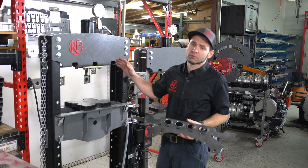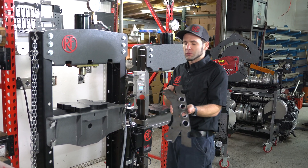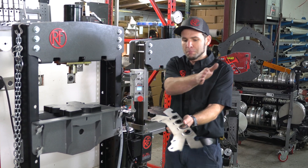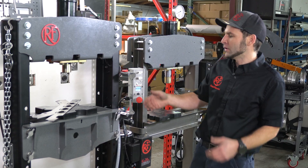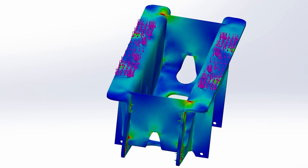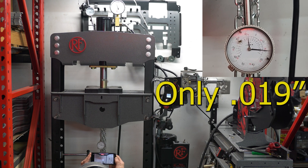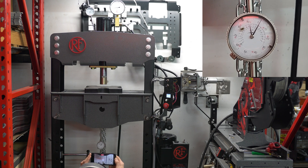The VersaPress is really great for precision pressing and will be great for press brake operations once released. This part is going to be formed right down these ovaloid cutouts. If you have a really flexible table — like the one in the Harbor Freight 20-ton press — and you put a press brake in there, that table is going to bow near capacity. That bow makes your bend form a smiley face shape, which is not good for fitting parts or maintaining design integrity. We did 25 design iterations on the VersaPress table, with finite element analysis — a stress simulation in CAD software — on every single one to optimize it so all the steel is carrying load and it's as rigid as possible. We predicted and then tested in real life about 35 thousandths of an inch of deflection with a single arbor plate in the center. With two arbor plates, a lower die, and a punch, the assembly is even more rigid, so actual deflection will be less than 35 thousandths.